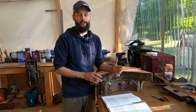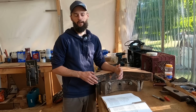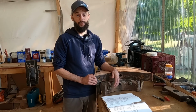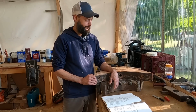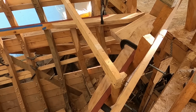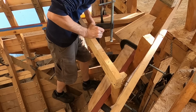And I'm going to kind of split the difference a little bit. We don't have a giant grown timber that we can put in there. I really don't want to weld up and stick that much bronze in the stem and stern. It's 1, really expensive, and 2, I don't think it's really required. But I would like to do a little bit beefier than what Victoria had and more in line with what Atkin had drawn. This is what I came up with for the stem breast hook.